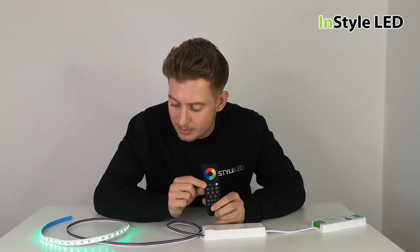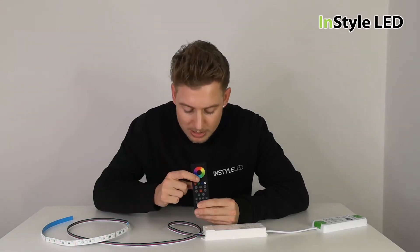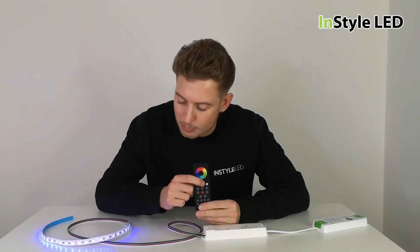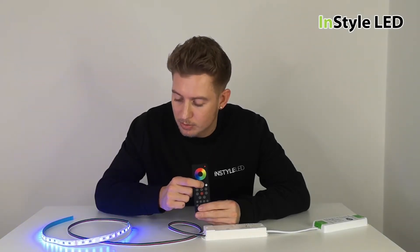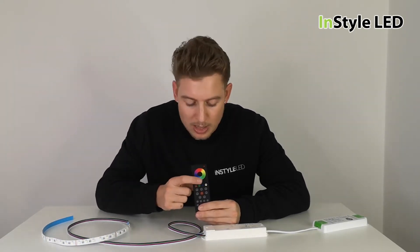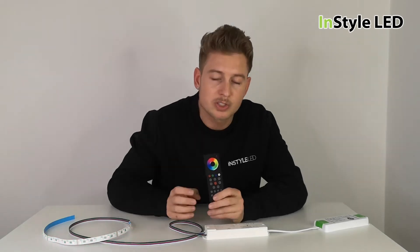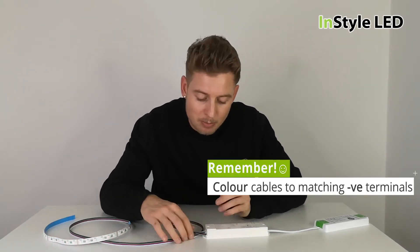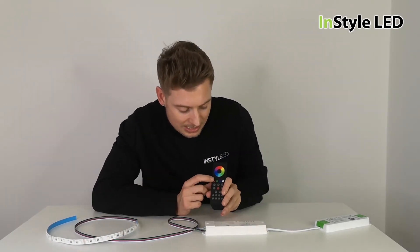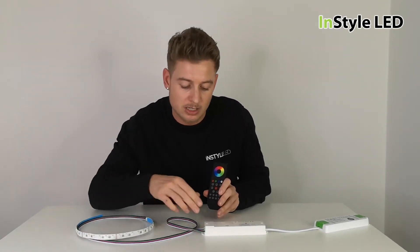If I click red, this should show red — but in this case it shows green. Press red again: off. Press green: we get red. Press it again: off. Blue: we get blue. White: we get white, which is correct. So white is correct, blue is correct, but green gives red and red gives green — those cables are mixed up. At that point you would go in and switch the red and green wires over. That is a great way to test: adding 100% on, taking 100% off, to see if the colours are wired into the correct ports.